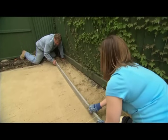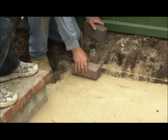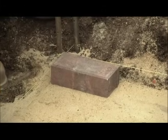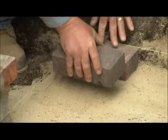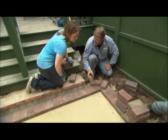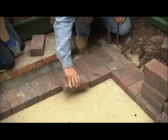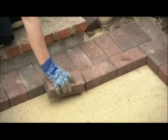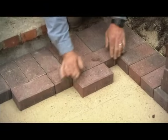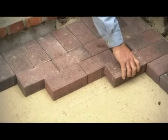This stuff is super important — it's going to determine how you pave the site, so we're going to take our time and get this right. Putting the pavers down is going to go quick. I'm going to come down here and go right to my 90-degree corner — there's my first paver in place. The trick with pavers is not to drag them in the sand; you want to click it and drop. Our header course is in place and we're going to start our pattern — it's called running bond. It starts with a whole brick running all the way down, then the next joint spins offset.